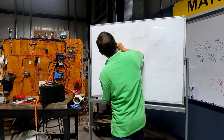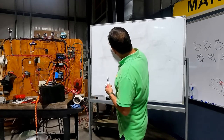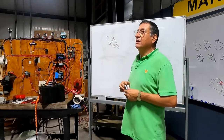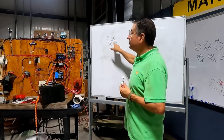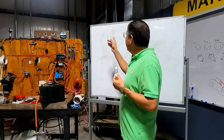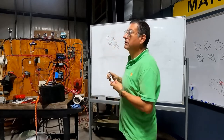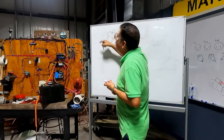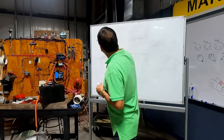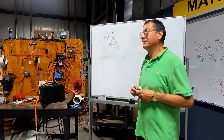This is the body of the sensor. Suppose this is the temperature sensor — this is the element that sends the temperature. That sensor only has one terminal. Where is the ground? Because the sensor is bolted on the block of the engine, the ground is on the body of the sensor. There are also sensors that are bolted but have two terminals: one terminal is ground and the other is the signal to the gauge.